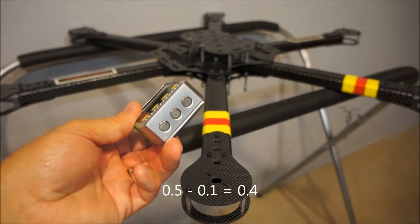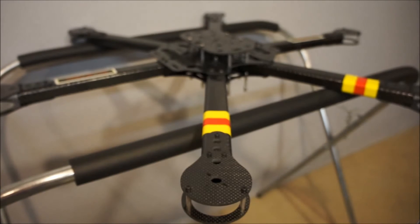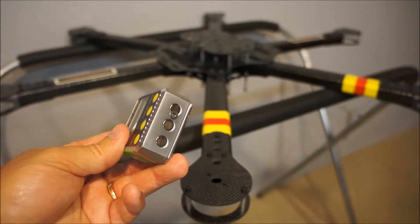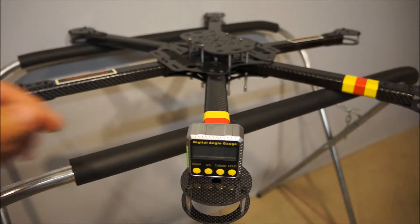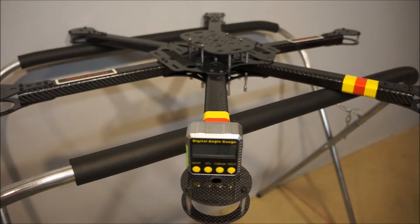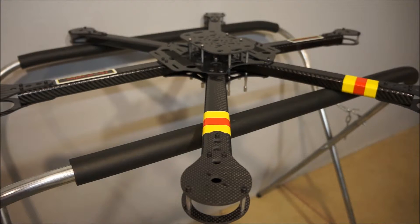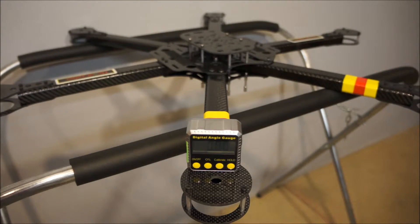This particular style has magnets on the bottom which make it really helpful in indicating what is going on. We will apply a shim to the bottom of it — you can see that the shim is there; that is a .2mm shim. We will set it back on there and let it calibrate itself. It is at .2 now. You can see now that I have it properly positioned it is sitting at .00 to .1, doing the exact same thing it did when it was on the center frame. We also note that the shim is on the right side of our digital angle gauge.